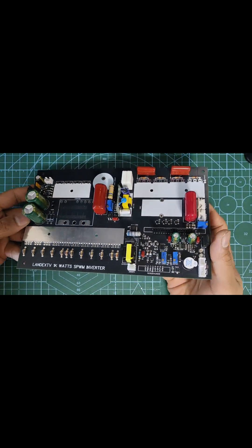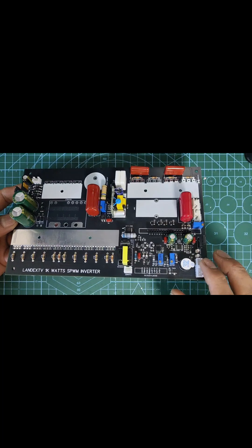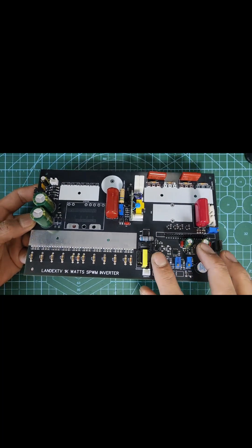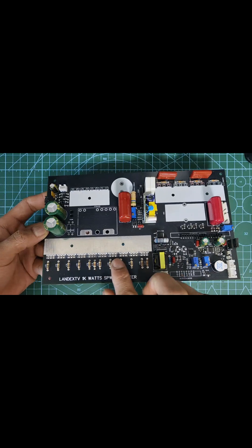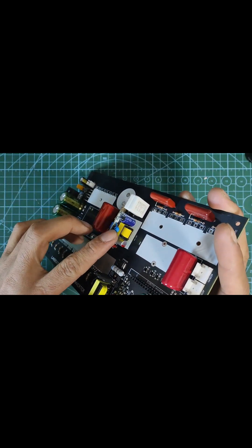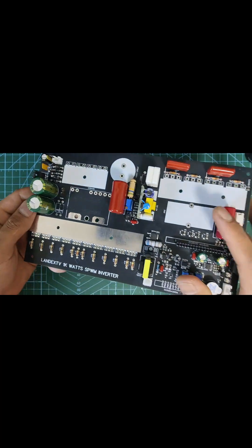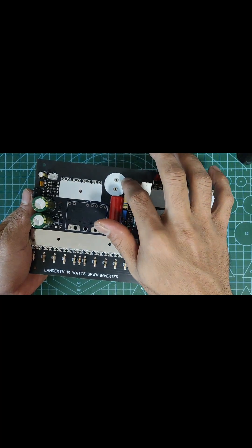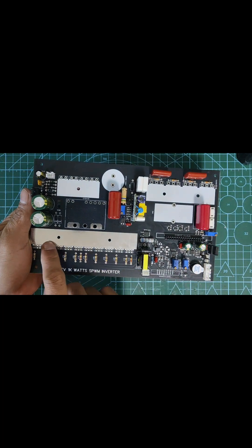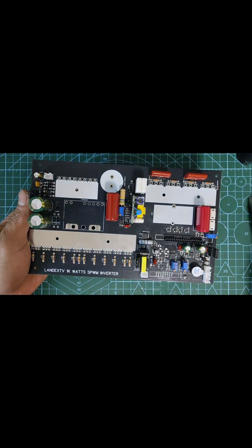This is the result after some of the through-hole components have been soldered. I used a GDT to drive the DC MOSFETs. This is the power supply for the H-bridge in the SPWM module. I used 10 MOSFETs, 5 on each side. The MOSFETs I used were 75NF75 MOSFETs.